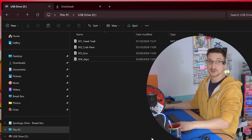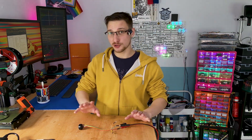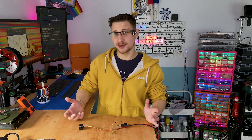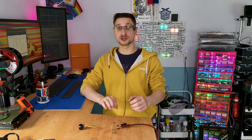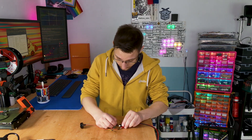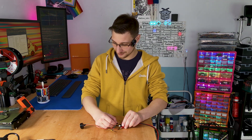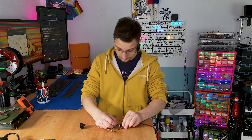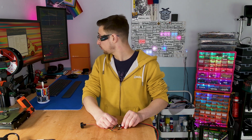I'm done uploading files, so let's unplug it and play around with it. I'm going to power it through my bench power supply and control it using its P1 pin, which is kind of like a button pin. It can do next, previous, play, and pause by tapping P1 against ground. Let's try that. It's a little louder than I expected. Let's try the next track, which is Short Pulse.